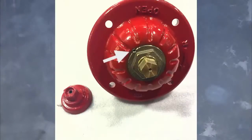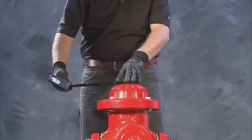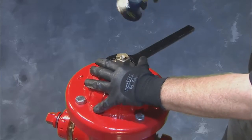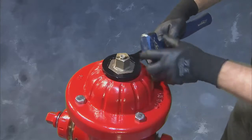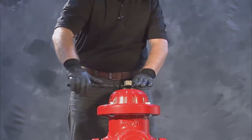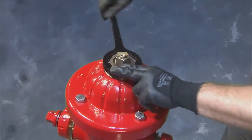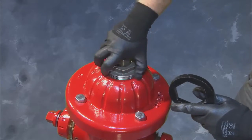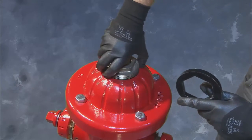On open right hydrants, you will also need a standard hex wrench to remove the small set screw between the thrust nut and the bonnet. Place the thrust nut wrench on top of the thrust nut and tap the wrench with a small hammer, loosening the threads in a clockwise direction. Remove the thrust nut and make sure the o-ring is undamaged before setting it aside.